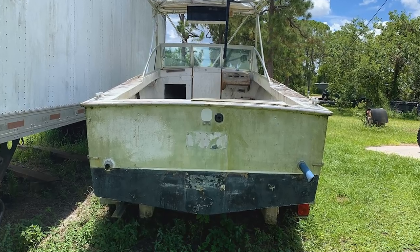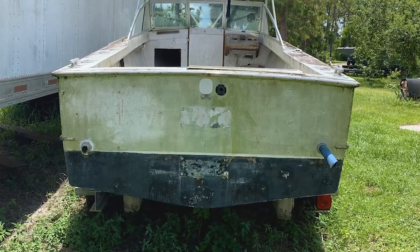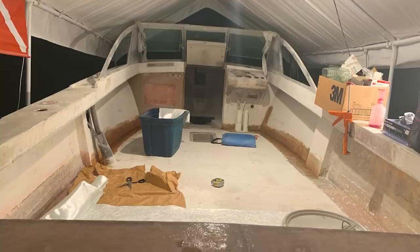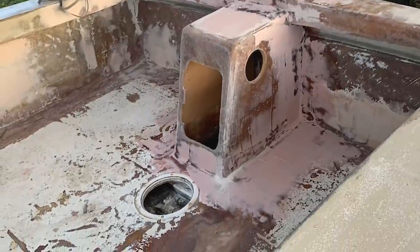The boat had already been converted to an outboard, but the transom had not been redone or repatched at all. All the through-hulls were already there, so I had to come back and grind it all out, rip it out, redo it, and re-fiberglass and beef up the transom for an outboard. The floor itself is all Nidacore flooring - everything is a composite build. I wanted to stay away from wood so it wouldn't rot.